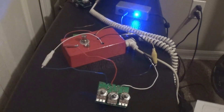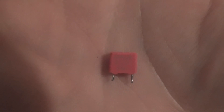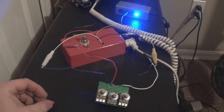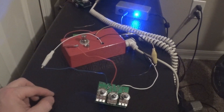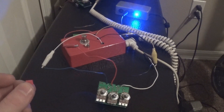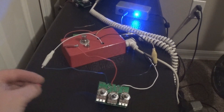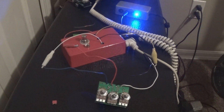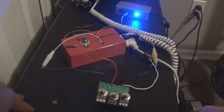...this red capacitor was in its place. Let's see if the camera can focus in on it. If you can see it in the video, it's a 47 nanofarad capacitor - so 10 times the amount that's needed, compared to the 4.7 nanofarad that should be there. 10 times larger than it should be. So let's take a listen now, keeping in mind that all these wires hanging outside are acting as a bit of an antenna and adding a little noise.